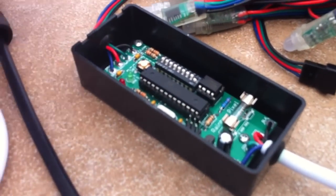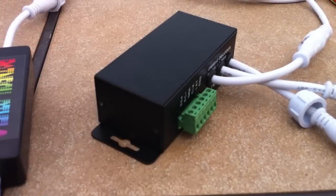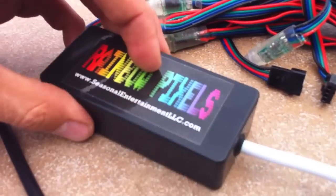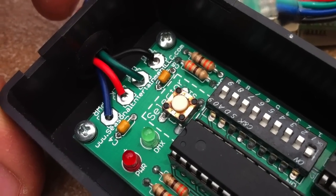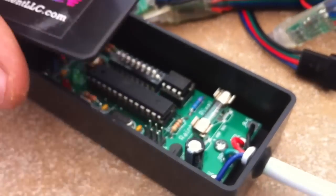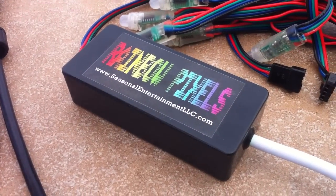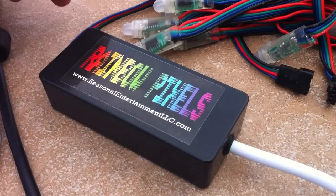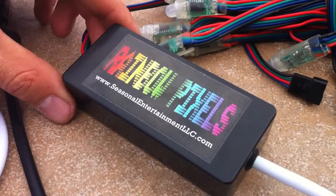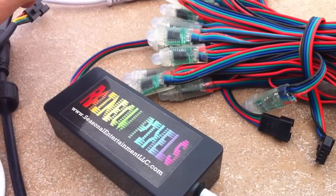The other drawback was the box itself. It's much more waterproof than some controllers — it's got a really nice plastic box, the top comes off so you can access the dip switches to change the address and the mode setting button. But as you can see, we've already got rust present on this button, and these haven't even spent any time outside — just our humid weather. I would have liked to see some type of gasket or seal around the outside of this box, and I may still try to modify that. But it is certainly much more water resistant than most solutions on the market. I would have just liked to see these type of waterproof pigtails on the pixel connections as well as on the controllers.